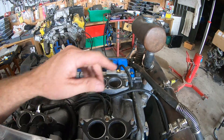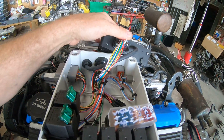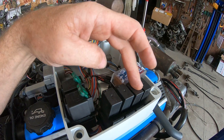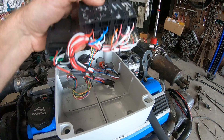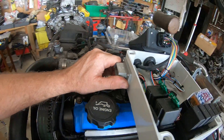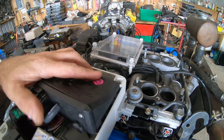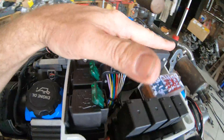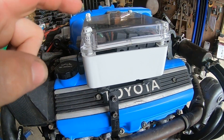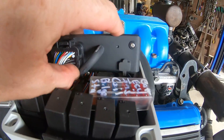Cold start was removed, and in this box I've put the ECU, relays for two fuel pumps, a bilge pump, a start relay, ECU, coils, and fuses. This all lifts out — you can actually service it and get at it. We plug in to the dash through there, bilge pump through there, and the fuel pump around the back. It's tight in this box but it all fits. It's quite serviceable.